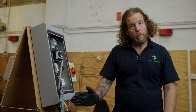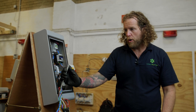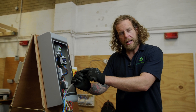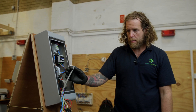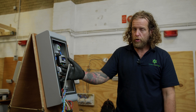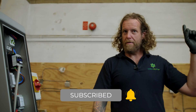The purpose of this video was just making off the armoured gland itself — I haven't terminated the cables, that will be for another video we're making. In here we have three cores of cable: we have a brown, we have a black, and we have a grey. Please remember the black has been deneutralised — we never use the black as neutral anymore, ever. So the grey will be your neutral and the black will be your earth. If you like the video, please subscribe and hit the notification bell.